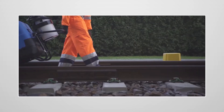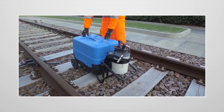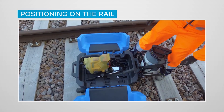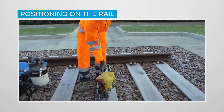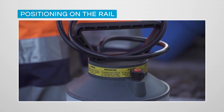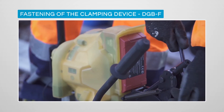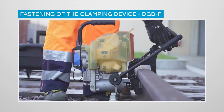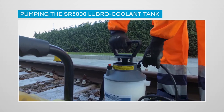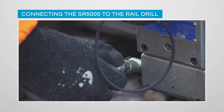The storage and transportation case can run on ballast, enabling operators to reach the working site comfortably and safely. All accessories and the coolant tank are stored in the transportation case. The positioning operation of the drilling machine is extremely easy: just let the template touch the rail foot and fasten the DBG F2 clamping device. The clamping system automatically aligns the drill to the horizontal axis due to the design of the dedicated MPAF template. The quick-coupling of the cooling system is controlled by a tap.